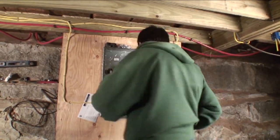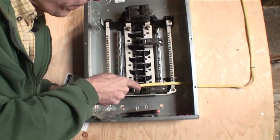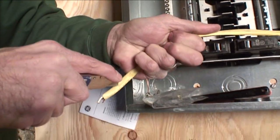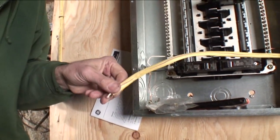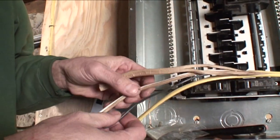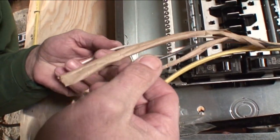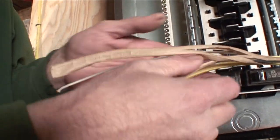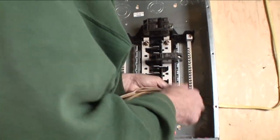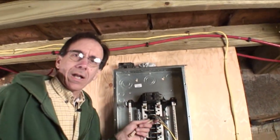I'm going to swing over to this side and take a razor knife and cut down the middle of the wire, carefully cutting that outer sheath. I'm cutting in the middle because if I peel back this cover, we've got the paper cover, and in the middle is where the ground wire is, which has no insulation on it. If we cut off to the side, we're apt to cut either the hot or the neutral wire that has insulation. So I've carefully gone right down the middle, and I'm going to pull that insulation off.